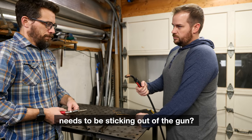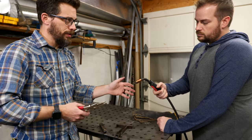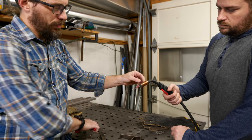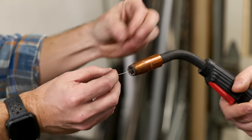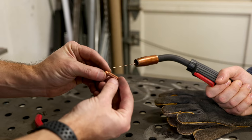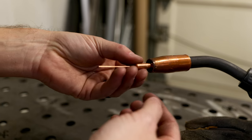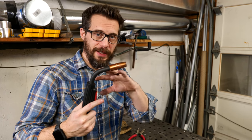How do you know how much wire needs to be sticking out of the gun? Usually the stick-out depends on the given weld, but probably a quarter inch to three-eighths of an inch is safe. You also have a tip in here that you can screw in and out. This is super dirty, so that's not ideal. Then you've got this outer piece — like a nozzle — that you can move to change where the gas comes out. This is the contact tip, which is basically a consumable — eventually they start to get broken down. So we're going to replace it with one of these new ones, and the wire comes through this little tip that gets screwed in on the inside of the torch.